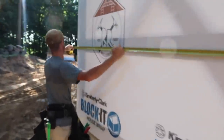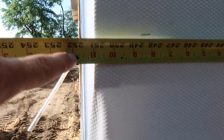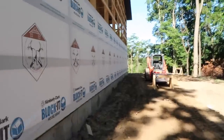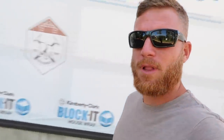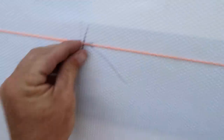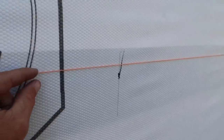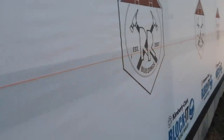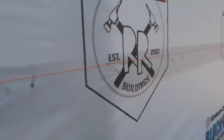Zach's marking these out - we can see we're at 20 foot 11, which is actually 21 as the leading edge of our steel. So we did pretty good - we're exactly where we want to be on a 72-foot building. That's obviously the goal. It takes a little bit of extra time but it's totally worth it. Now with the base trim up and lasered on pretty much as perfect as we can be, we're just going to take a snap line and make our mark. We always give ourselves a quarter inch above our wainscote steel because sometimes our steel is not perfectly cut - we've learned to give ourselves a quarter inch of slop in this trim detail. We'll get a nice snap line for what we call the double angle D2 trim above our wainscote.